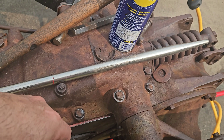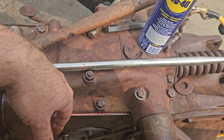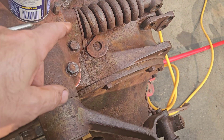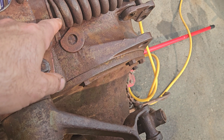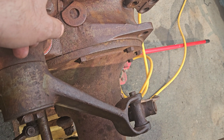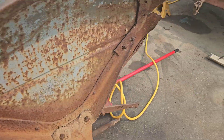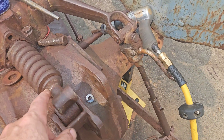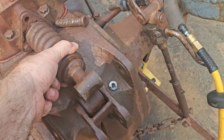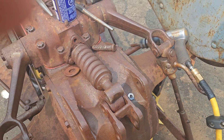I've got to get the parts. Unfortunately the only place I found them is in England. I'm looking at tractorparts.ca and I've sent an email to Sue to find the parts that go in the draft control — the plunger assembly. There's supposed to be a felt washer; this part might be compromised. I have to be able to unscrew the yoke, but unfortunately it's seized together. There's a rod in here with a screw on the end — that's how you set it up, and there's supposed to be no play in this.